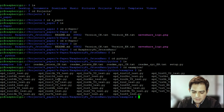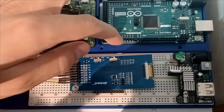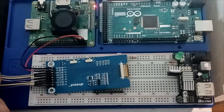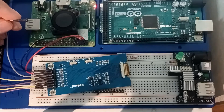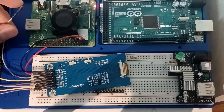After that we're going to head into the hardware setup. I already have VCC and ground hooked up — make sure your VCC dip switch is in the correct orientation: 5V for 5 volts, 3V for 3.3 volts. I added a resistor in those pins just to hold the display in place — they're not doing anything electrically. I'm pulling up the Raspberry Pi pinout since I don't remember all the pins, and I'll speed up the video while I make these connections.